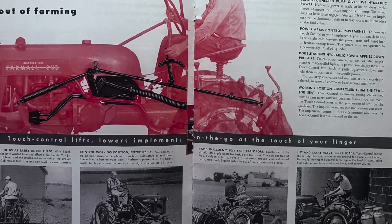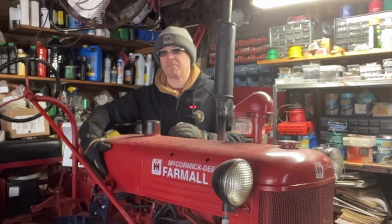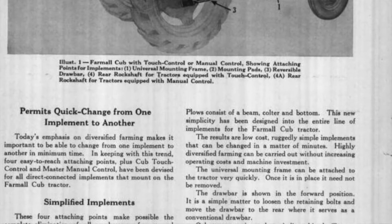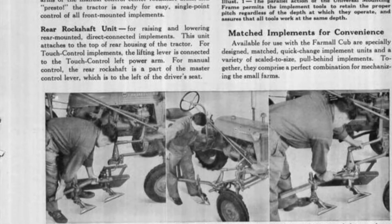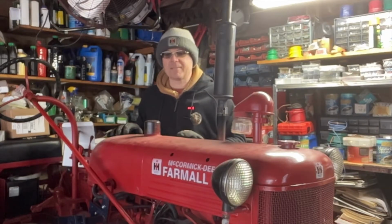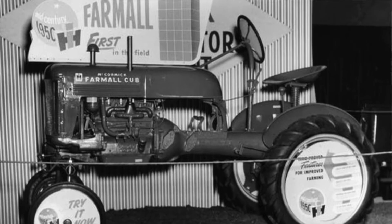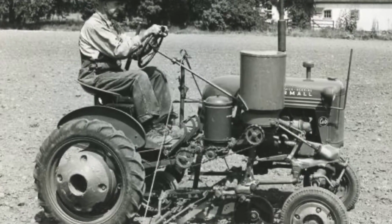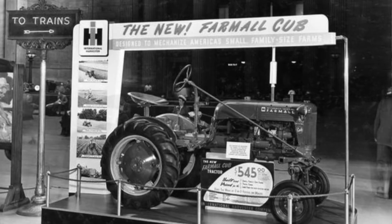One thing that Harvester did have is a way to pin up some of the attachments. So if you had, say, a sickle mower on the front, you could pin the sickle mower up and take it off the lift and still use the back lift. But you couldn't really put a snow plow or a land plow on with the mower, so you still had to really shuffle attachments around. International wanted to make what they called easily swapped out attachments. The age of quick-tach and super fast installation and removal of tractor attachments hadn't dawned yet. So International was pretty much a pioneer in trying to make things as simple as possible. They had these mounting pads in different places on their tractors and used mounting bolts. It wasn't too terrible to do, but it was still a lot more time-consuming than obviously a fast hitch or a three-point hitch.